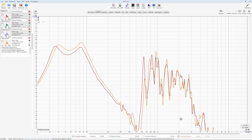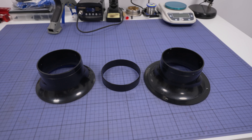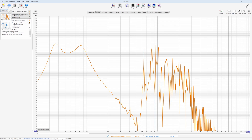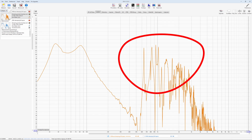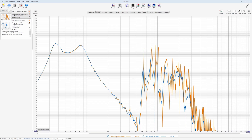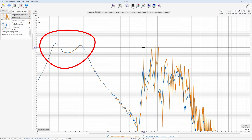The response with the port using just the flares is also fine — if you're lazy and don't want to do any cutting, use that port. So we got the response that we wanted. There is some high-frequency content to take note of: you could completely ignore it and rely on the low-pass filter to eliminate it if you set it low enough, or you could use some damping material on the walls of the ported chamber to reduce it significantly. With damping material, some peaks are reduced by 10 dB, which is great, while the playable range looks identical and no useful frequencies are absorbed.